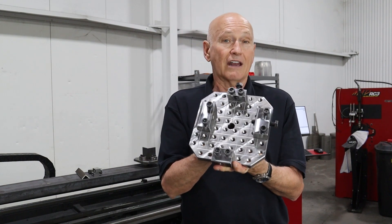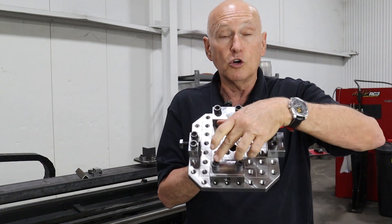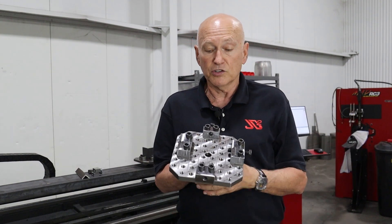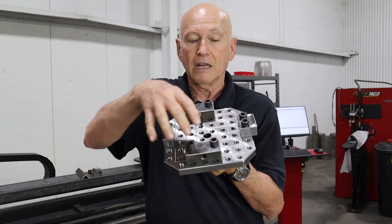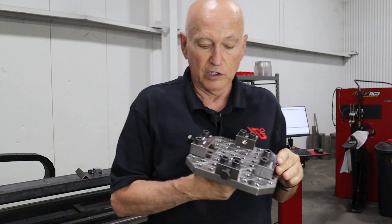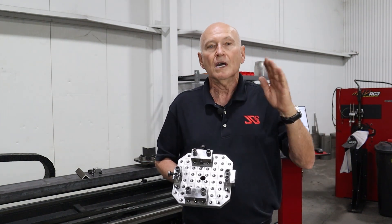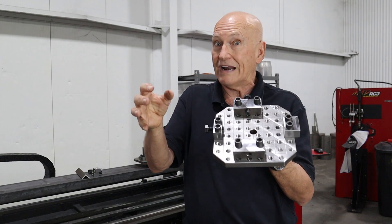On this particular setup I've got this setup to handle four by six rectangular tubing. I put one of the long blocks with two inch hole spacing and positioned it — the edge is two inches off center, because four inches divided by two equals two. On the six inch side, I did the same thing — I am now three squares away with the edge directly on the line. When I load the tubing, it's going to go against this face and this face. These two blocks here are offset an eighth of an inch off the line, because when's the last time you saw a piece of square tubing that was perfectly square? They typically may have a bulge at the weld seam, and that eighth inch extra clearance is provided to accommodate that bulge.